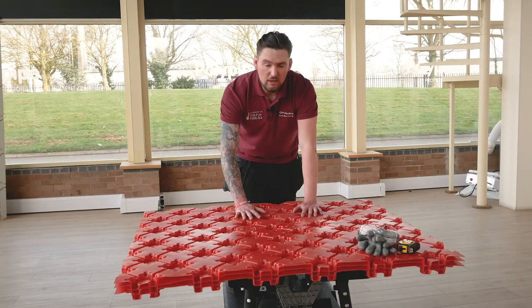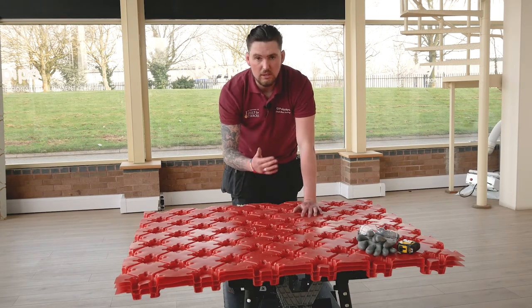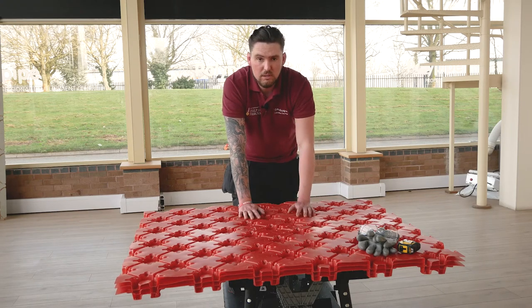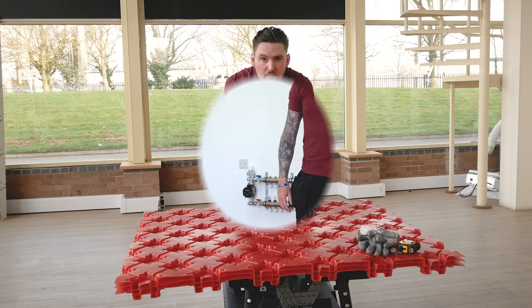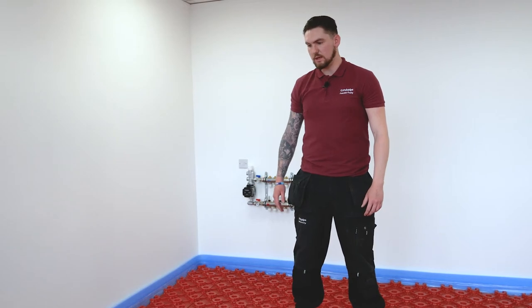When you come to actually mark up the panels to cut them to width, it's very important to remember that you take your measurement and add on an additional 10mm — that's purely because when the three-quarter castellation sits over the half it actually overlaps the panel by 10mm. A good tip when cutting several panels of the same width is to stack them three or four high to give them more rigidity, clamp them to the workbench, and cut using a fine-tooth hand saw or a circular saw. As you can see, we've cut the panels to size, infilled them, and locked them in place.